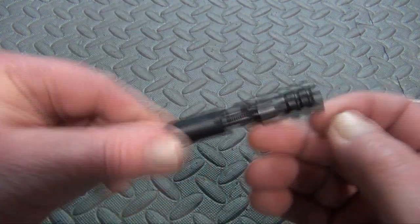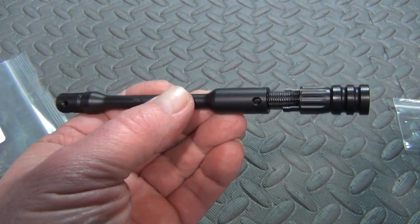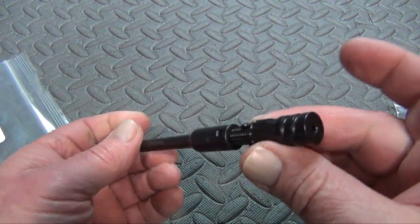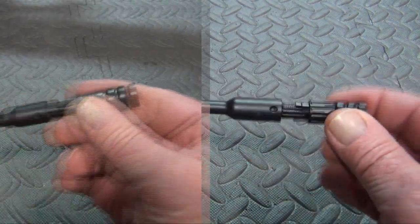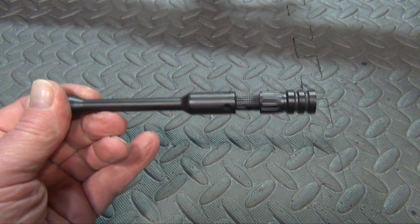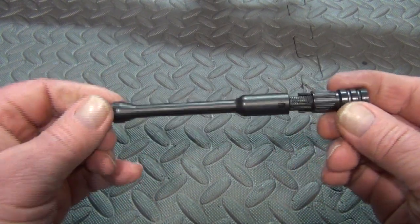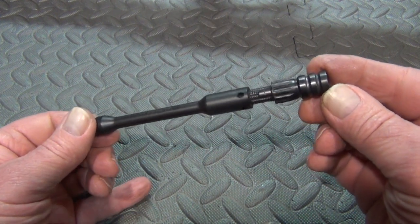And we'll go over the specs. Okay, it is machined from a corrosion resistant heat treated stainless steel. Receives a black nitride coating to protect against wear and corrosion. It is rated for suppressed and full auto. So if you're lucky enough to have one of those, it is made 100% in the USA and has KNS Precision's lifetime warranty.